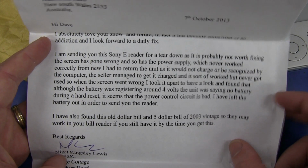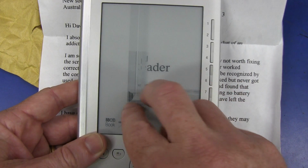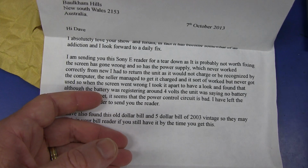Well, there's some sort of row and column thing gone wrong there. So, that's rather interesting. Anyway, offhand, I don't know. Is it the driver chip or is it just an internal connection or something like that? No, it's got to be a driver because it's fed data, and of course the data on these just sticks there, and it doesn't need any power to keep it going.